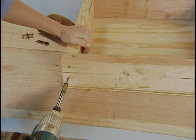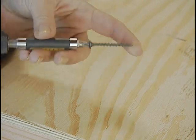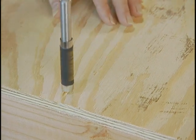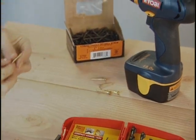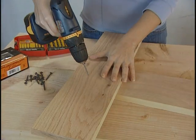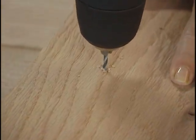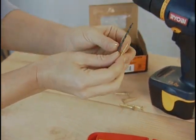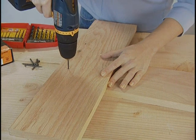When two things have to be screwed together, most carpenters reach for a drywall screw. Made of hardened metal with sharp points and aggressive threads, they drill their way through plywood and hold things firmly together. Other screws — like the brass or steel screws used to hang a door — are too soft to push through even soft pine, so you need to pre-drill a pilot hole. The pilot hole should be the diameter of the screw shank, and you can often find the correct size listed on the back of your tape measure.